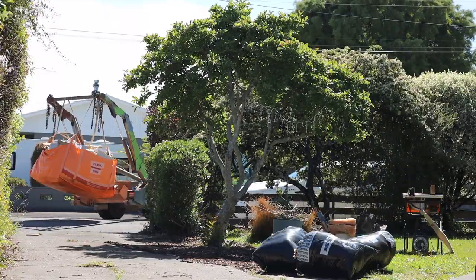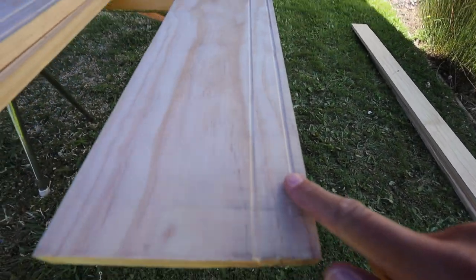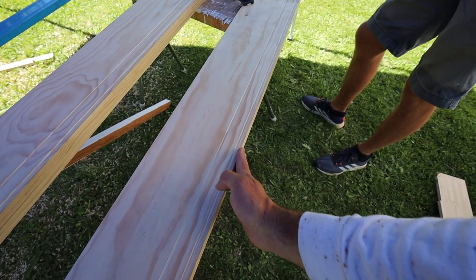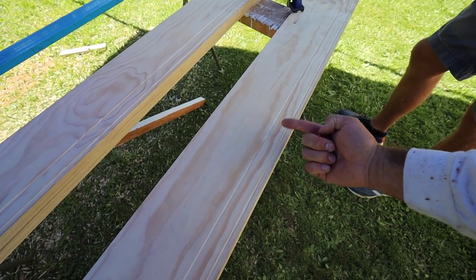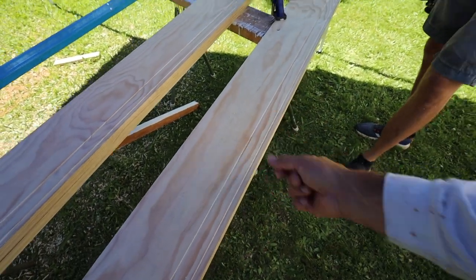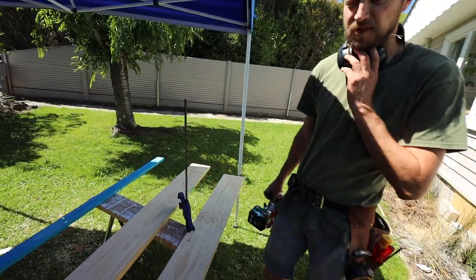It's all happening — we're building a door. Essentially we are using second-hand parts, we've got a door leaf and everything, but we're building a whole new jamb and sill, and that's exactly what Ray has been doing. Nearly finished there, right? Nearly finished. So this will be the front of the jamb, and these two grooves will be kind of hidden when the door's shut, and any water gets between the jamb and the door it runs down there rather than getting caught. You explained that quite well.